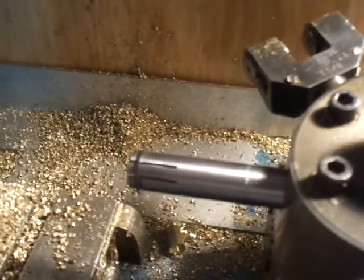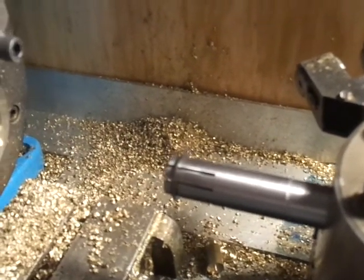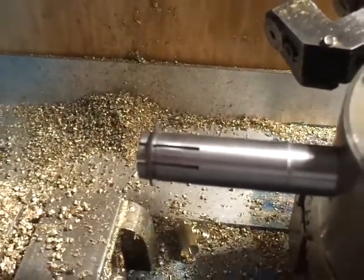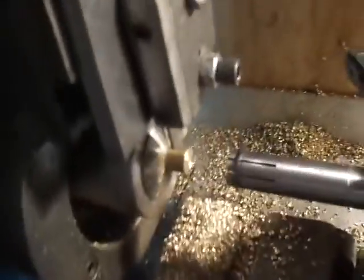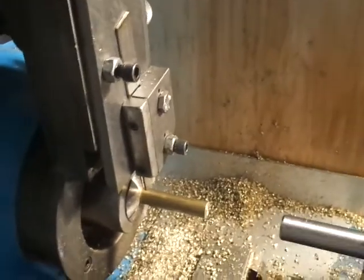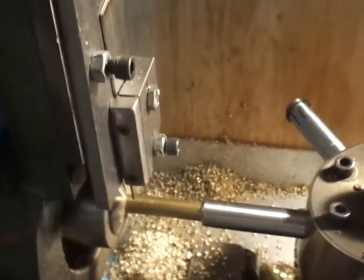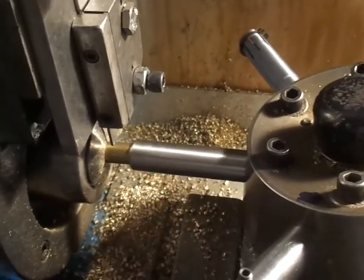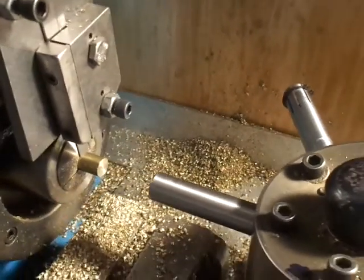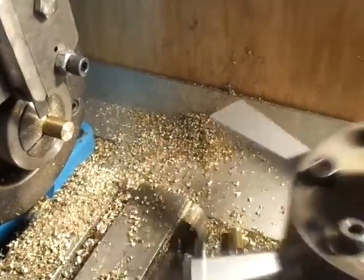The process starts with a puller here — a simple little tool with a hole sized for the material I'm working with. Then I use a slit saw, and a circlip ring to keep tension on the stock. When I release the collet, I pull the stock out and close the collet. Then I pull the puller off. This is a step stop — basically a piece of material with a slight counterbore so the burrs don't give me an altered dimension.